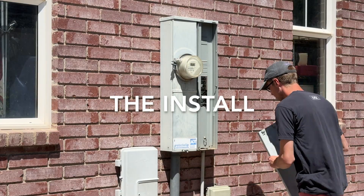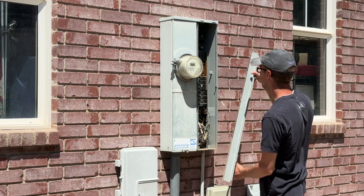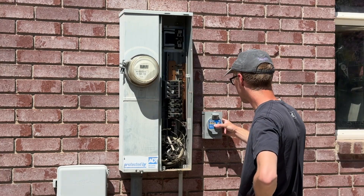To be able to tie it into their house we needed to add two things. The first was a power inlet box which is commonly used for generators, and the second was a breaker interlock which totally isolates the grid from the secondary power source.